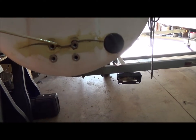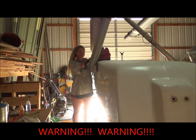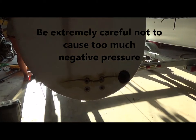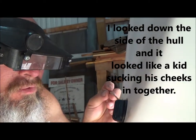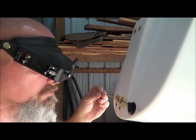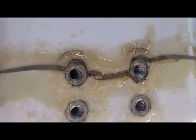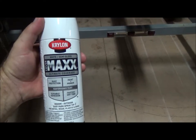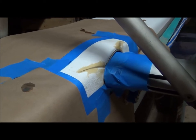I know for a fact that it was leaking right at the very bottom right corner. This time I've got Brooke with me and she's going to push the towel down into the hole to create a little bit more pressure. After having run the shop vac for three or four minutes while applying the very runny epoxy, it should have sucked some epoxy into the little crack that ran right along the side of one of those bolt inserts. I'm pretty confident that this leak is going to be completely sealed.